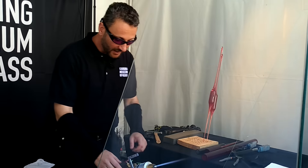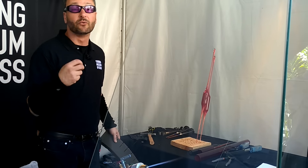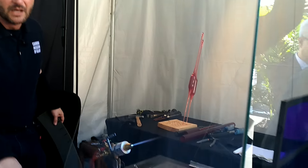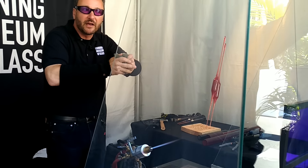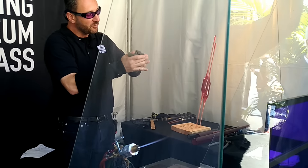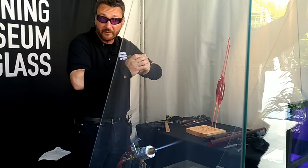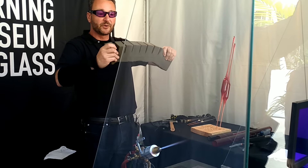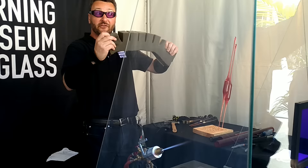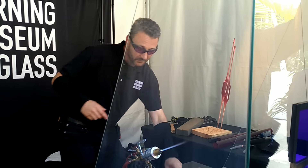What I'm going to do here is heat some glass, get it really molten, and drip it in a water bucket. The water is going to cool the surface very quickly and cause the glass to compress on itself. With this foam, I can keep pushing on it all day long and I'll never break it — I just keep making it stronger as I compress it. That's compression stress, which gives strength. But if I pull on the foam I'm creating tension stress, which will eventually tear it apart — tension creates weakness.